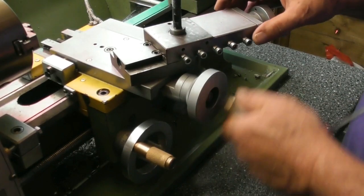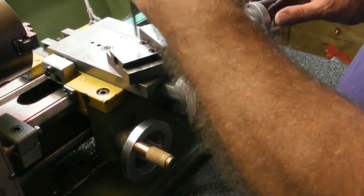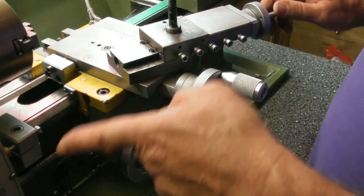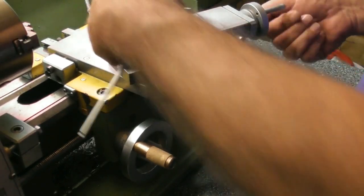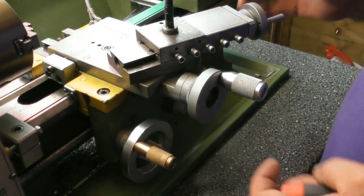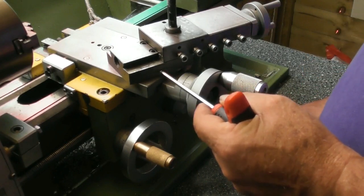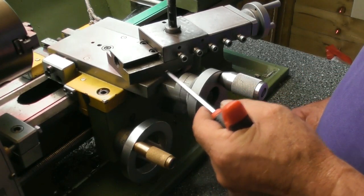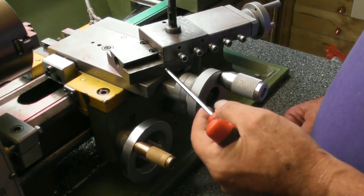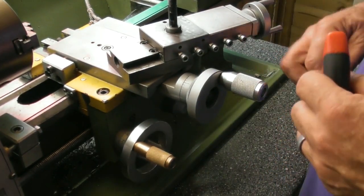So to make any adjustments you'd have to loosen the two screws, rotate it to the angle you wish, but with the carriage right back it fouls on the hand wheel. If you set an approximate angle with a protractor and then wish to clock it in to a certain number of thou per inch on the outside, you've got to wind it all the way back again, and if it's out you've got to wind it all the way back again. Larger lathes have a recess in the side with captive bolts in a rotating track where you simply do up two nuts, one on either side, without all this winding back and forth.